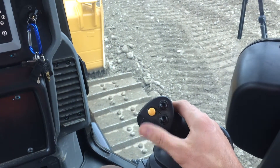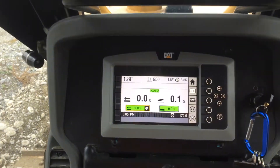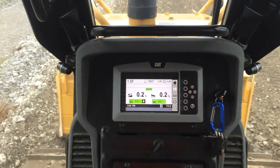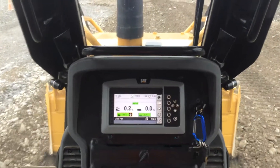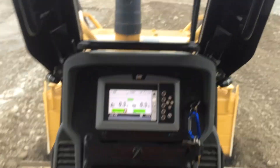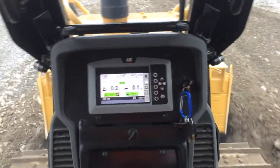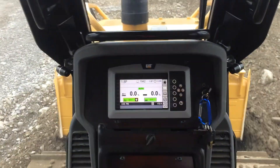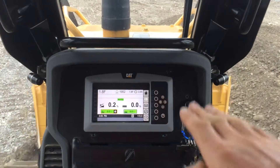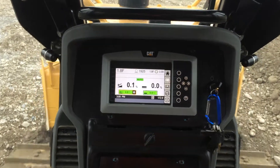So we're ready to get underway. This is the auto button — the yellow one. Into autos. Indicators go green. I'm going to start powering up, and as I travel along, slope assist is controlling the blade pitch and also the tilt to maintain those targets.